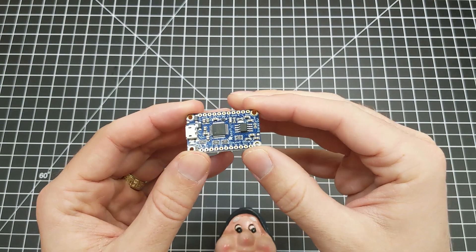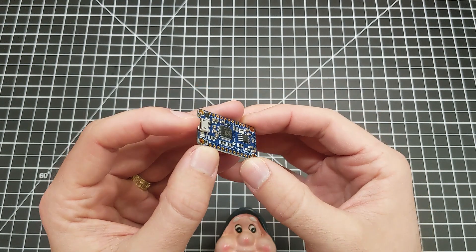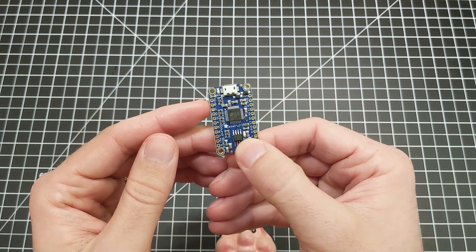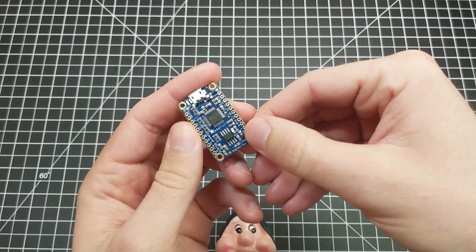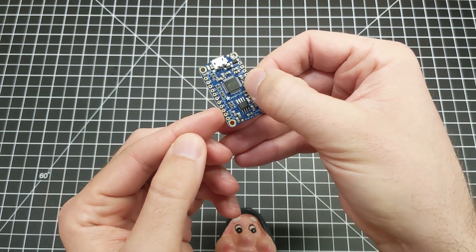To actually play the audio I picked up this soundboard from Adafruit and this thing is awesome. You just plug it into your computer with the USB cable and then you drag on whatever audio you want, and then you trigger it by just connecting one of the trigger pins to ground. This is great because it means you don't need an Arduino or any other kind of microcontroller — you can just trigger it with a switch.